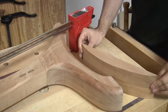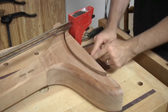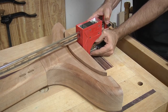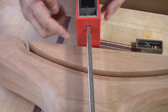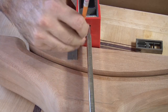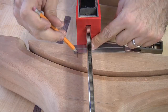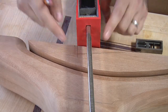Over by the bandsaw I found this little guy. You can see exactly where that piece came from — this is going to give us a nice curved surface that will spread the pressure along the entire bottom piece. But it doesn't solve our angle of attack problem, because when I close up the clamp in line with the vertical piece, I'm only making contact at one point. Here's a simple way to use the clamp itself to give us the exact 90-degree notch we need. I'm just going to grab a little straight edge, put it alongside the clamp, make a pencil line there, then run this across the front to get a perpendicular line. When I cut this notch out, I'll have a perfect little pocket for the clamp to sit into.